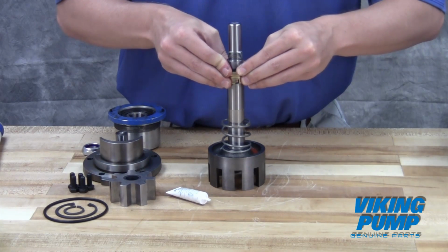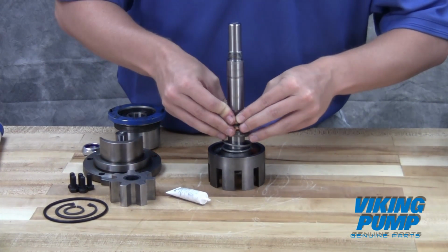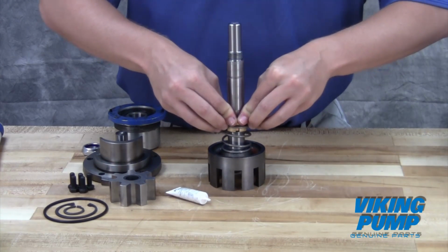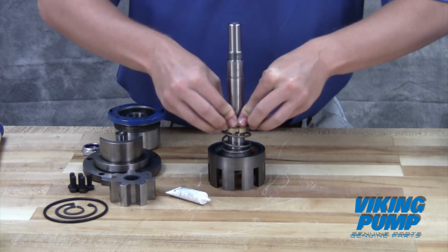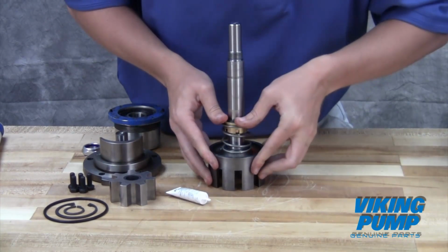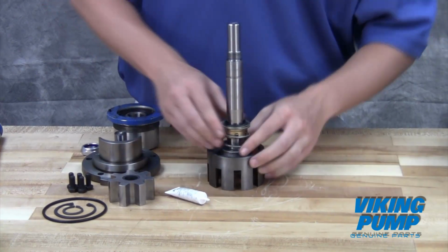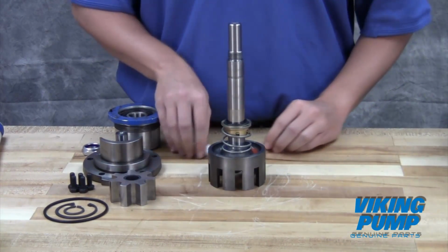For the wedge or O-ring style seals, slide the seal up against the back of the rotor. G and GG size seals of this design may require use of a press to seat the seal hardware around the hub of the back of the rotor. Again, do not push directly on the seal face. Remove the seal clips and tighten the set screws.